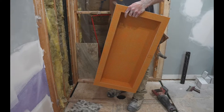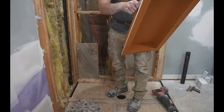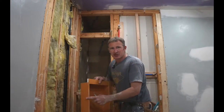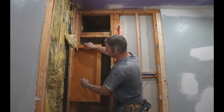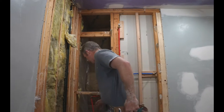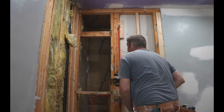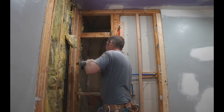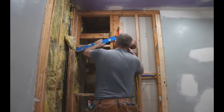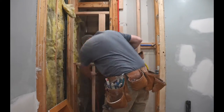We're going to cut out the stud on that as well. By cutting this off, when I install this, I'll just be butting the other half-inch board straight up to the niche. The framing I made was about a quarter inch bigger than the actual niche itself to give some wiggle room, and I put up a 2x4 flat ways so that I had some framing behind the niche.